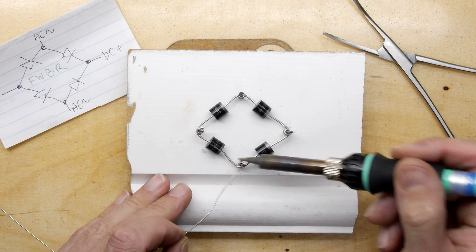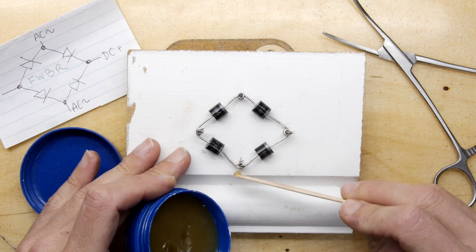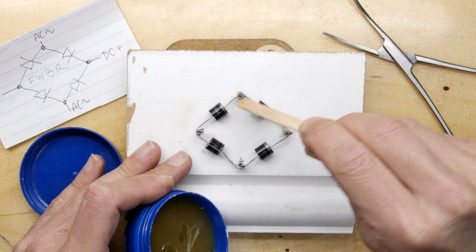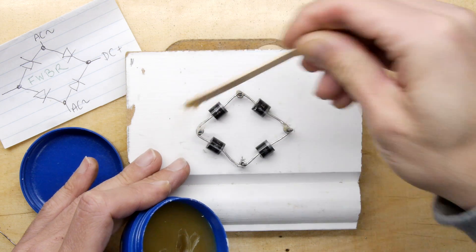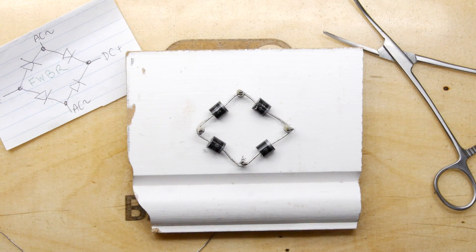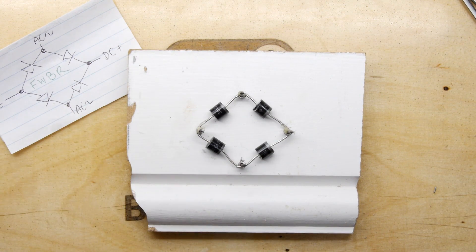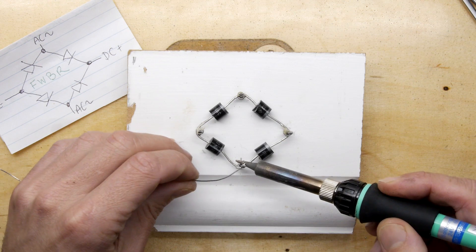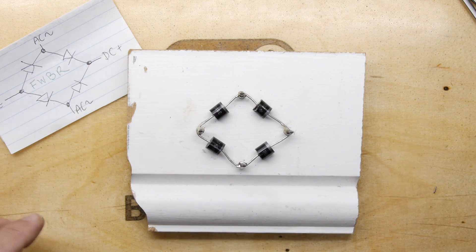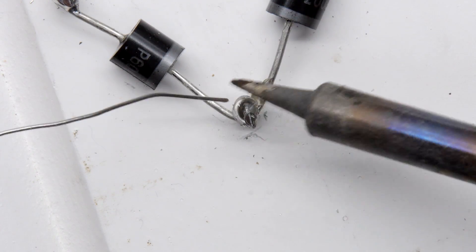That's the essential stuff there done. I'm going to solder these joints together — we've got the iron nice and hot. Let's use some flux, I'm just going to put a little dash of flux on each one. It's like proper brazing — like we're making a stained glass window. A little brush might just be the right thing for applying flux. I'm going to push this down, it's all in contact. Come on now — give us some heat. Yes, that works really well.